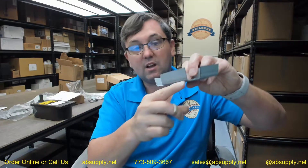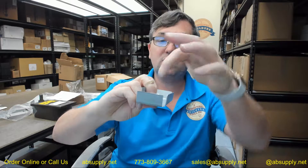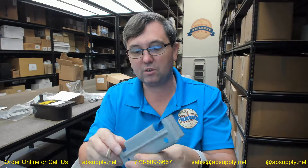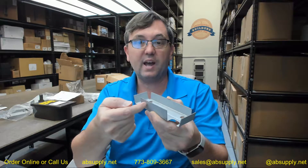You could, I suppose, use this as a floor anchor as well — you would probably want to cut this portion off, get this into the base, and then tack weld it. You could use these holes to anchor the frame down to the floor, though it is not usual to use it for that sort of application. I don't see why you couldn't. I don't see you being able to use it for any other application except maybe for an existing wall if you were to drill half-inch holes through here. But you would just use a multipurpose anchor if you needed to be more flexible. Now, it is not a wood stud anchor — you are not going to take double 2x4 wood studs and drill all the way through 3 inches of wood just to hit this flange. They make a type with a bend-over ear that would wrap over the sides of the wood stud that you would screw in through the side, and then the drywall would come up into the throat of the frame. So this is literally a metal stud anchor.